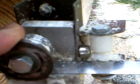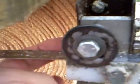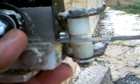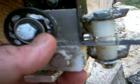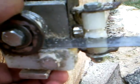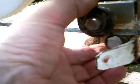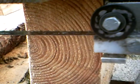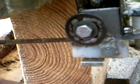And one of the more interesting new features, the most interesting new feature, is the self-adjusting band guides. What these are is they pivot from just in front of the band, and so what happens is if the cut goes above the cut line, then the band aims itself down. If the cut goes below the cut line, then it aims itself up. So they correct themselves, and there's no adjusting of the band guides because they do it themselves. So compared to most band saws, you have way less adjustments.